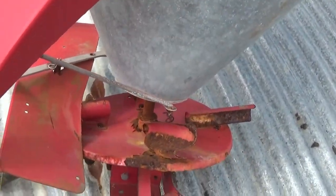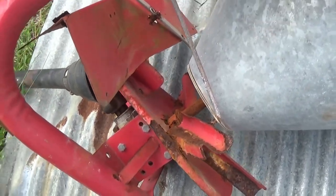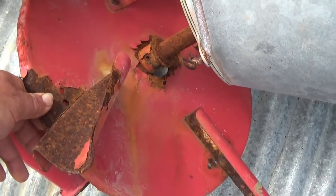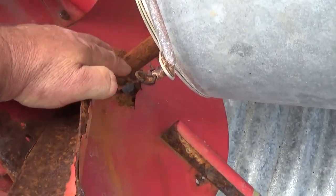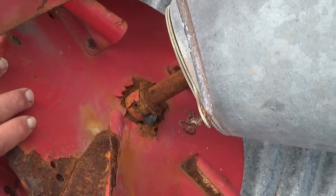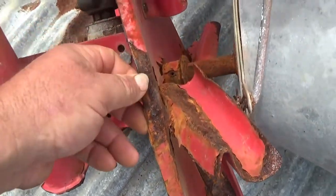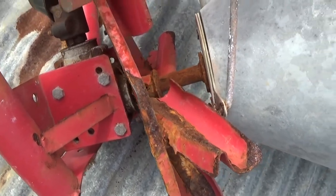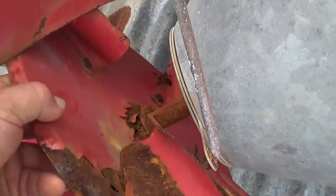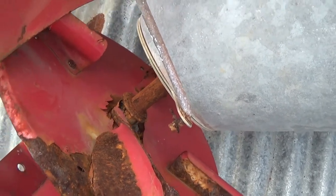I'll just tip it up, lay it down on its side. From this angle you can see it better, but this plate here - this plate that I'm just moving - it's obviously where it's welded on here, hasn't really been good enough. I don't really understand why. It's done a fair bit of work, but still, you wouldn't think that it'd - the steel's only probably about 1.5mm thick, and I think what's happened is this, just from flexing up and down, has just cracked around where the edge of the weld was and broken off.